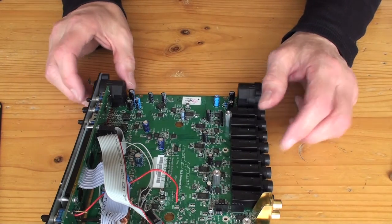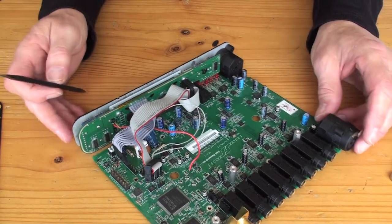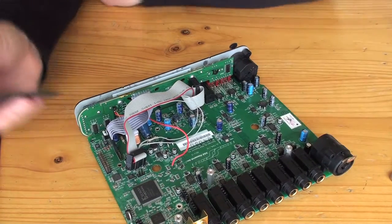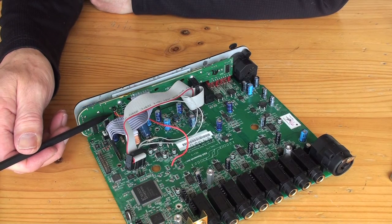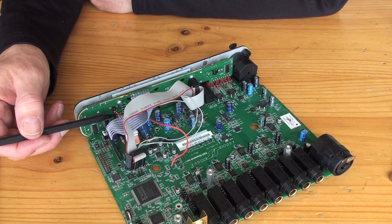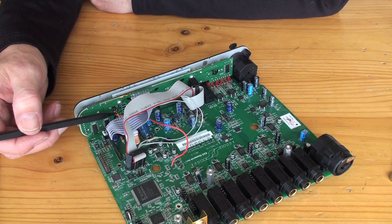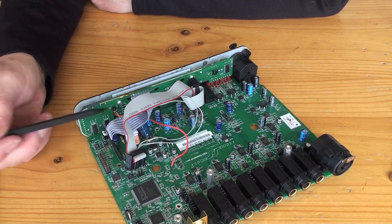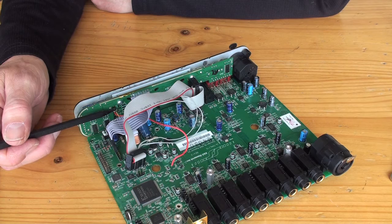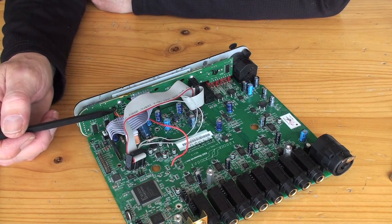Now, you can see here where I've soldered onto, just there, you've got an anode connector that you can solder the other end of the wire through to. I've removed the original voltage supply there. This is the ground down the bottom. Now what I found using a multimeter was that I was only getting 3.5 volts here, which isn't enough to light the backlight LED up properly.